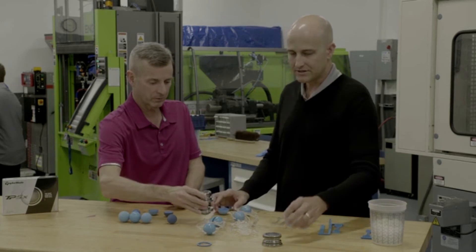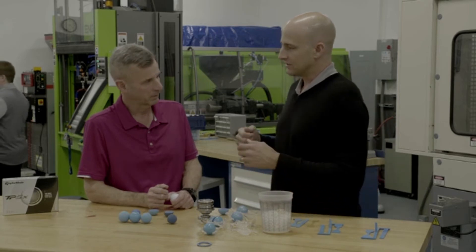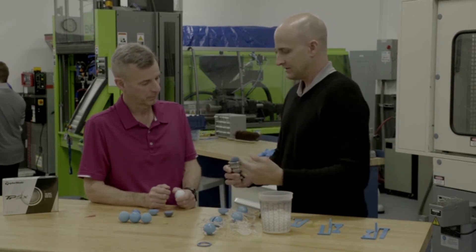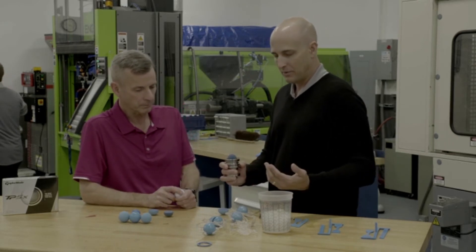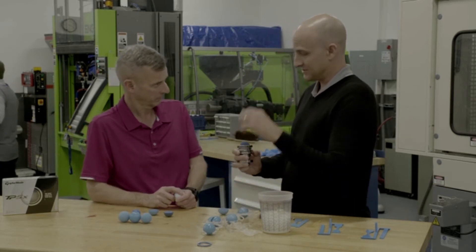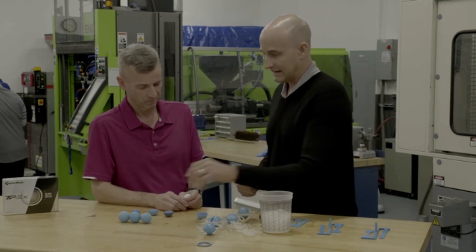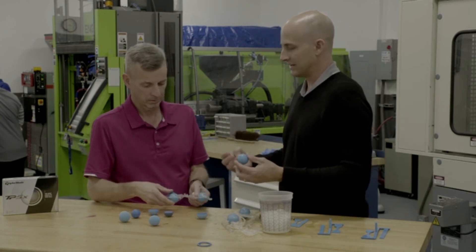So it goes into something like this — we're using these plastic pellets, and it goes into a heated barrel section. That material is going to get injected into a mold base and into a cavity that will be smooth. We place an insert into the cavity, the material gets injected, and when the material wraps around that insert to a point where it's supporting the insert, those pins will retract. Then we fill the remainder of the void so that when the part comes out, it looks like this. Again, we grind it so that it's perfectly round, and we go to the next process.